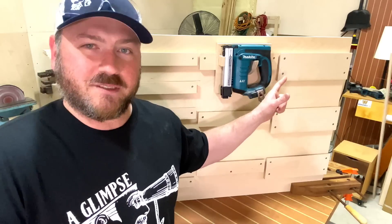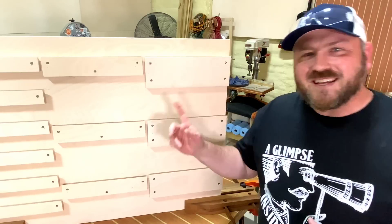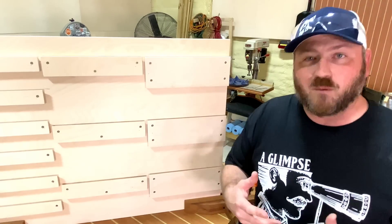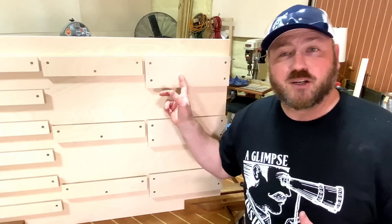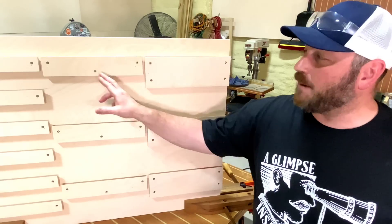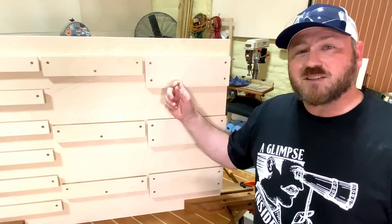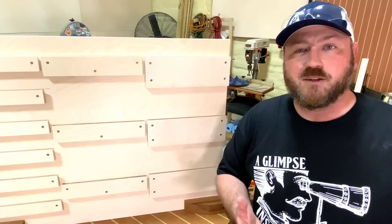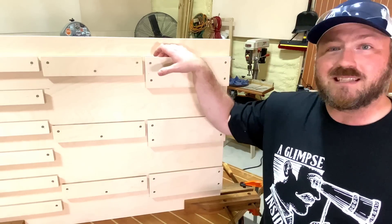I definitely recommend the third system if you don't have plywood walls — if you have drywall and studs in your garage or shop. You're going to space the cleats every 16 inches and you'll want the support of two screws roughly three to four inches apart, giving you a lot of rigidity since you can't put screws every five or six inches into your walls. This one is great because you can use one-by material — one-by-sixes work great. You just tilt the blade to 45 degrees and shave it off, and that's what your cleats consist of.